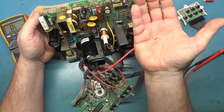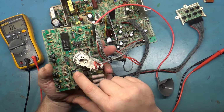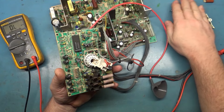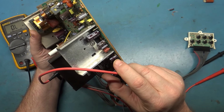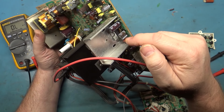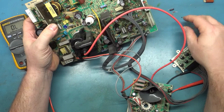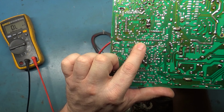So we had the R402 needing replaced, the R613, and also this capacitor here on the neck board, C507, which is supposed to be a 100 microfarad cap, and they had a 10 microfarad cap in there, so I changed that out. So we just had these 3 components, along with several other issues. The solder joints for this one were lifted and almost broken. The solder joints for C613 actually had 1 broken pad. All of these 3 caps here had lifted pads. This one had lifted pads. I had to make some trace repair on that one. Various things like that. So just 3 components and some bad traces, and there was a solder bridge across these 2 pins right here.